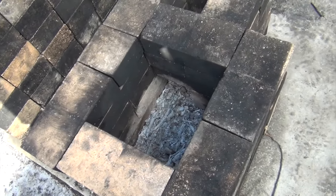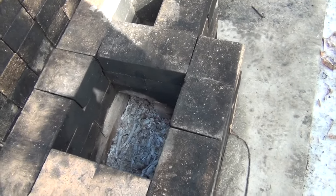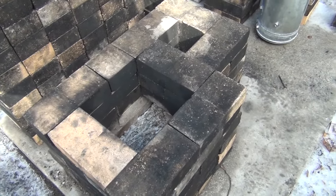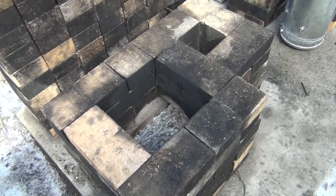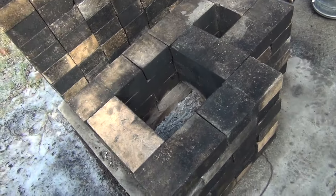And that's the real advantage of a J rocket stove, that only the bottom part is burning. I mean, the true rocket stove, even though you get some smoke in the house, is a J. Nothing drafts as good as a J. It's a reverse siphon, a thermal siphon, and this incorporates some of the principles of the J, and also of the Sidor stove.